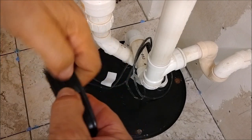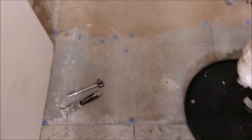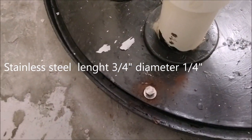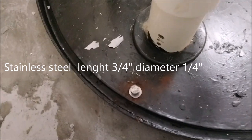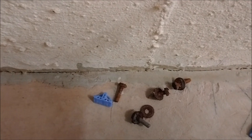First, I removed the tiles that were here because working on them was dangerous and I could crack them. The rubber here is very difficult to show — here's the rubber; I just put it around this cover. I already put two screws in — I didn't close them yet, but I put the new screws I purchased from Lowe's: stainless steel, three-quarter of an inch. By the way, the washers are also stainless steel — very important. You can see the old washers are very rusted and the old screws may not even be stainless steel.